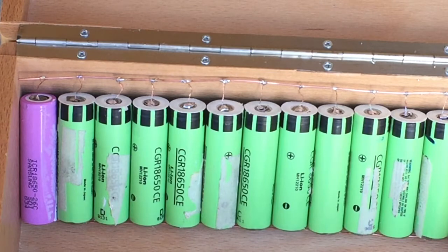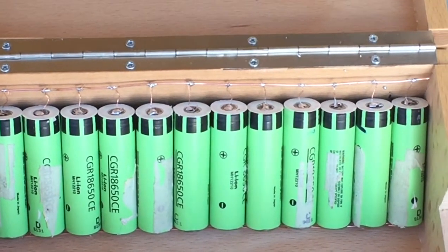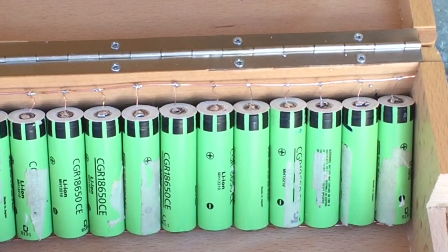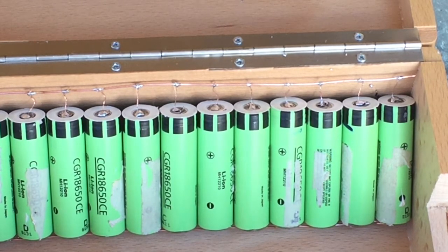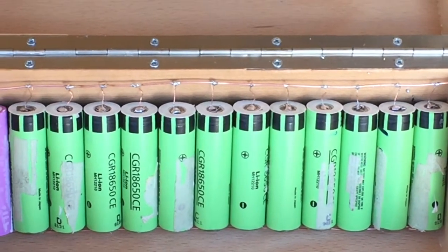What we've got here is something similar to the way Tesla fuses their lithium-ion cells for their car batteries. You can see across the top there's a bus bar with multiple links down to the tops of those 18650s, and underneath — you can't see it — there's a bus bar connecting all of the grounds together.